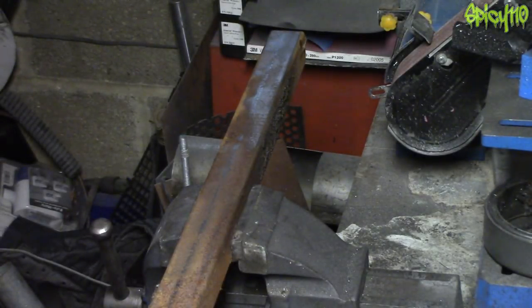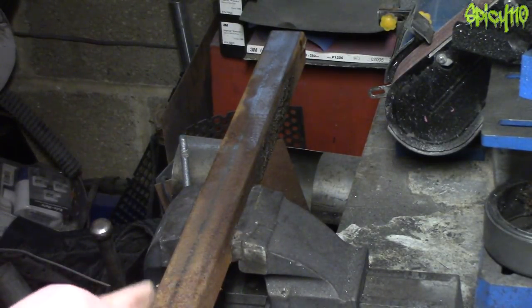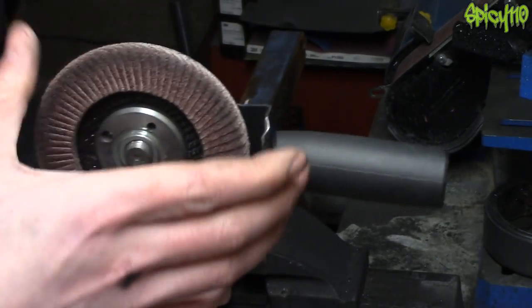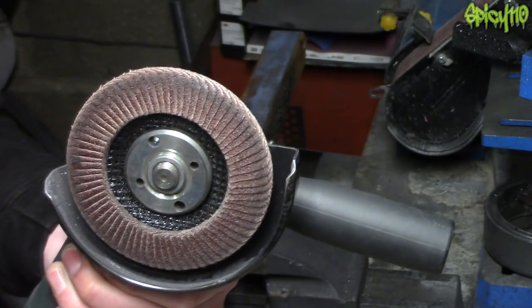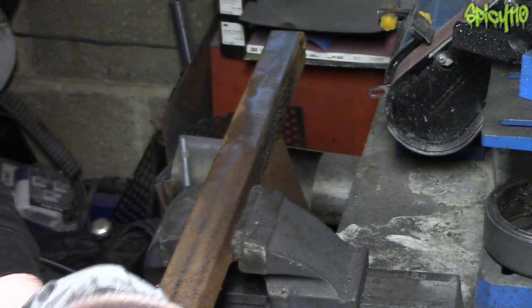This is why I keep my older flat discs — a well-honed 80 grit flat disc is a fine thing. Once it goes a bit too far it's time to give up, but you can keep those old ones for crappy jobs like this. Note: when doing up angle grinders, that is all that's required. If you do it up really tight, when it turns on — because of the way it's threaded — it'll get even tighter and then you won't get it off.